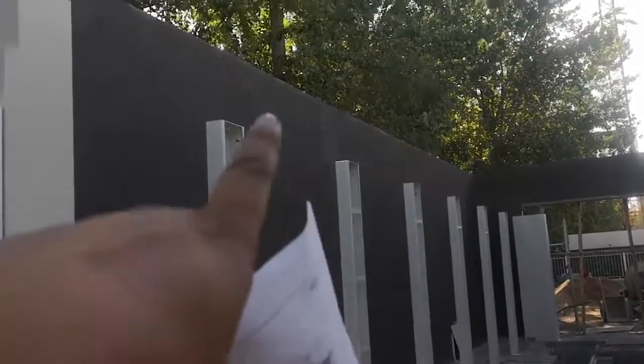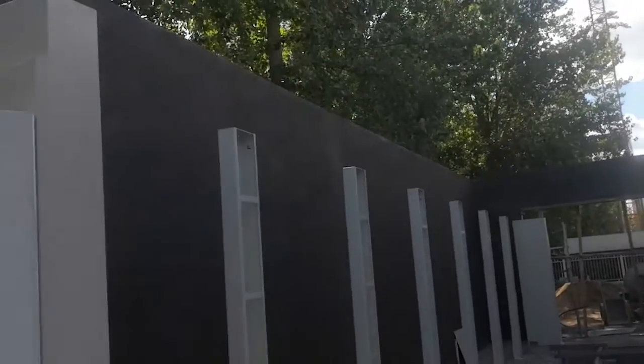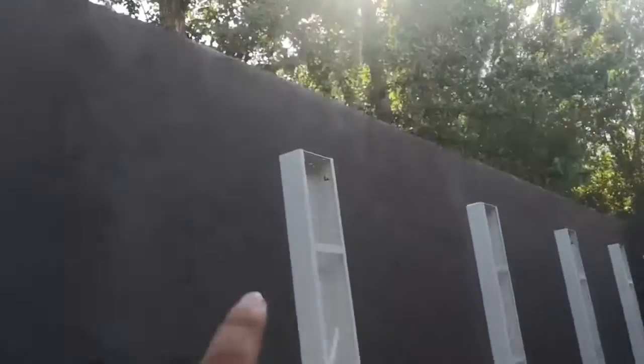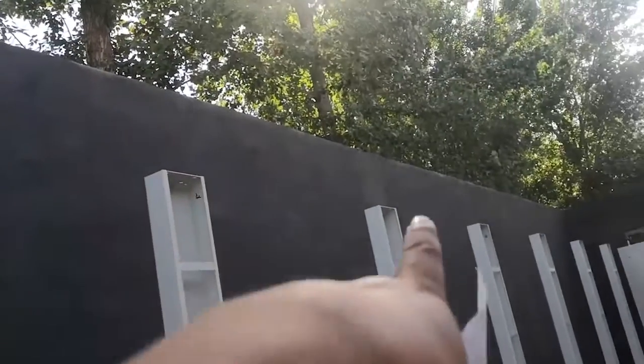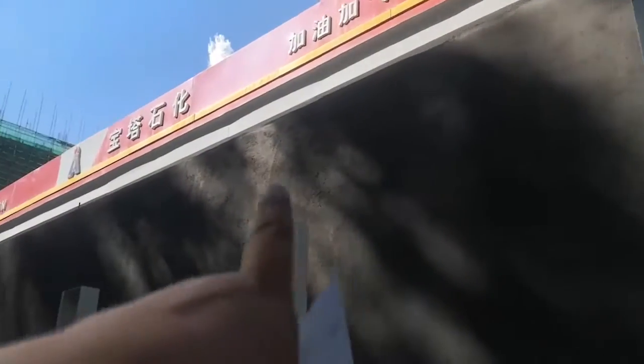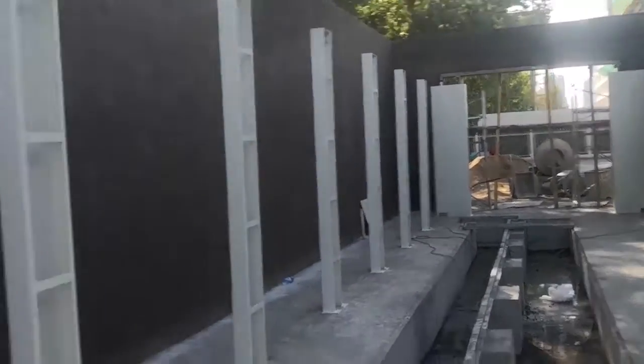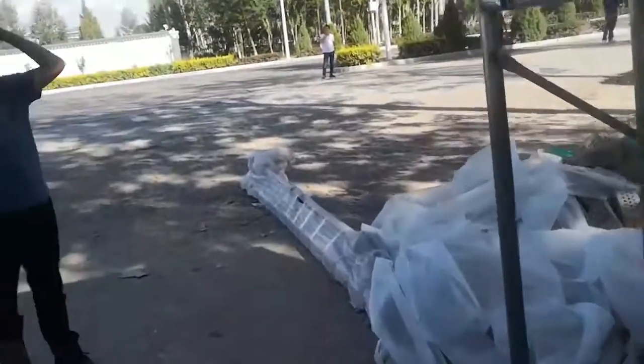Next step is to fix the side beam on the machine leg and box. So you need to find the right one. You may wonder which is the side beam first, side beam second, third, right? Side beam first, side beam second. Here you need to notice this box. You see here is a big hole, right? All the four boxes, 1, 2, 3, 4, all the four boxes have a big hole. So you come to find the correct side beam.